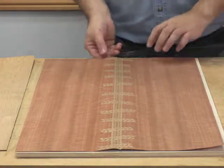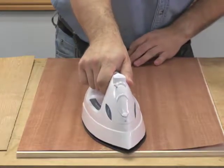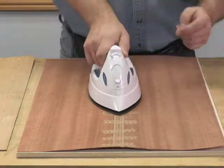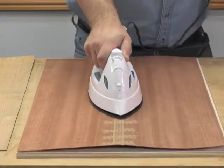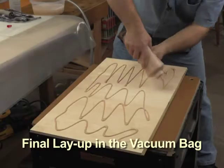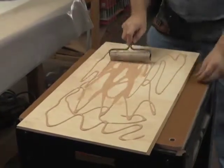We're going to flip both veneers over, but before I do that let me just hit it with the iron to dry the tape off a bit. If you have a whole bunch of joints to do, you might want to put the tape on one joint, iron it, then do the next and iron it — because when you dry it really fast with the iron it seems to shrink a little better than when you just let it air dry. From the point where you start rolling the glue on the first side to the point where it's in the bag with the vacuum, I'd say maybe 10 minutes or so — quick, but not that bad.